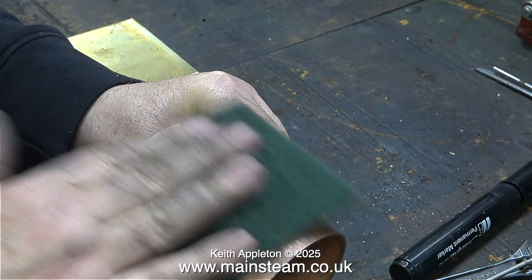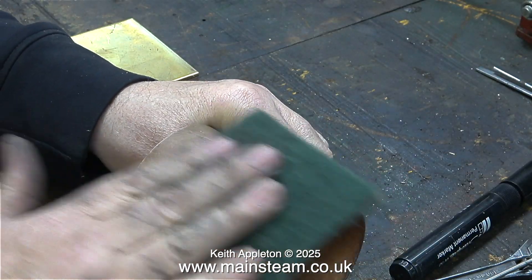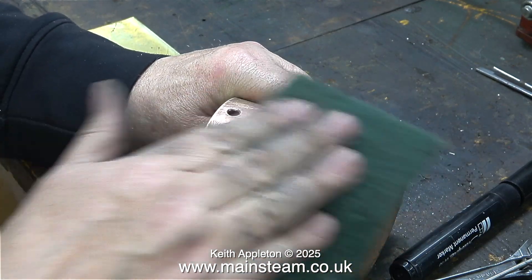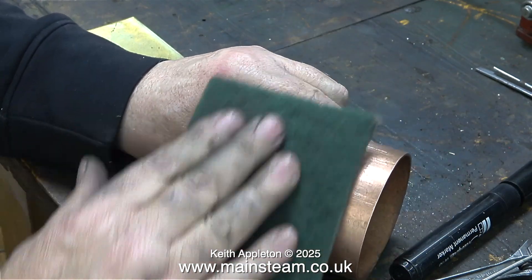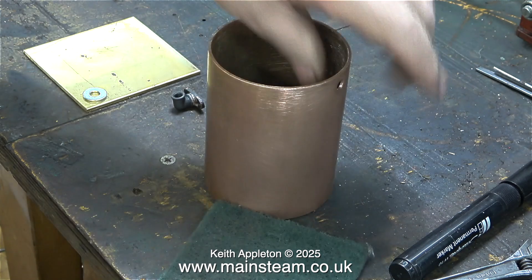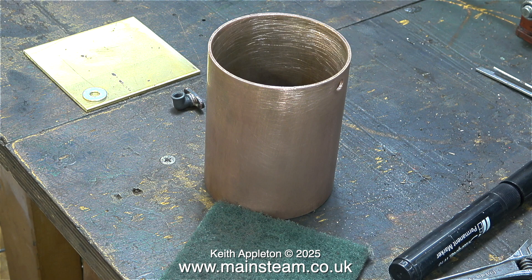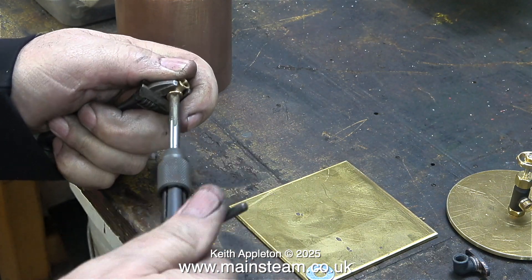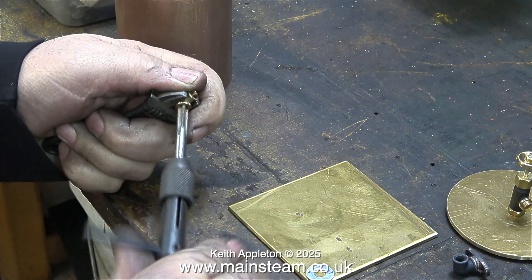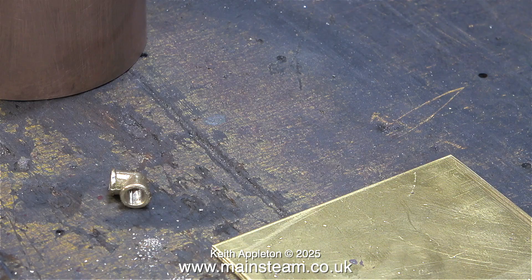What I'm doing here first, with very coarse sandpaper, is scratching the surface of the copper tube, then using Scotch-Brite I'm making a lot of finer scratches - this is to be a key for the paint. I use an etch primer which doesn't really etch the brass but sticks very well to it. I've also cleaned up the area on the inside at both ends and I will be soft soldering the part in this area. I'm going to fit another elbow to the steam inlet on the condenser, but it needs re-threading with the British Standard of 1/4 by 40 threads per inch.